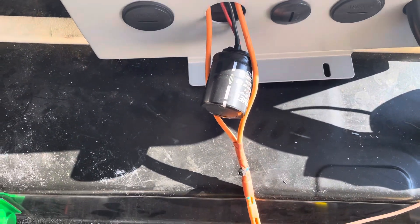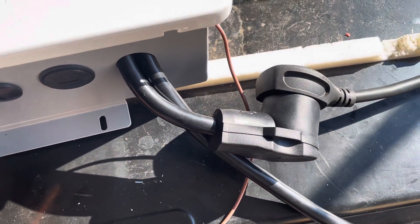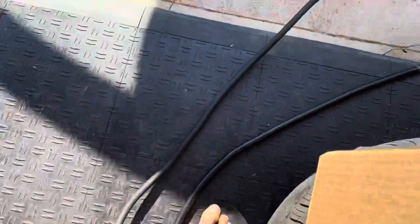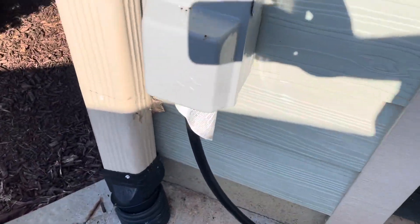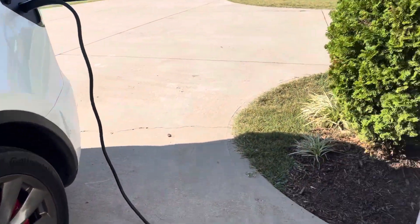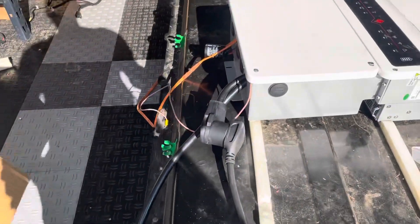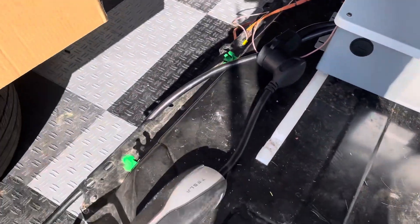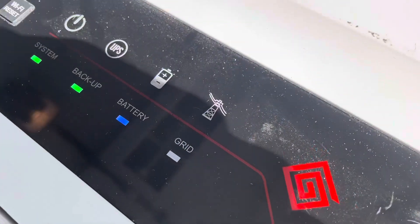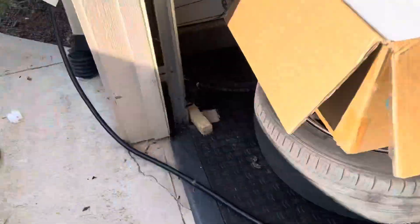I've got the HV-IL loop closed, the high voltage cable going to the inverter with the 500 microfarad capacitor, and a backup power 14-50 outlet hooked up to the backup power. The grid is connected to my 14-50 outlet outside. By these LEDs you can see that the backup is on, grid is down, and no power is coming in through this outlet.